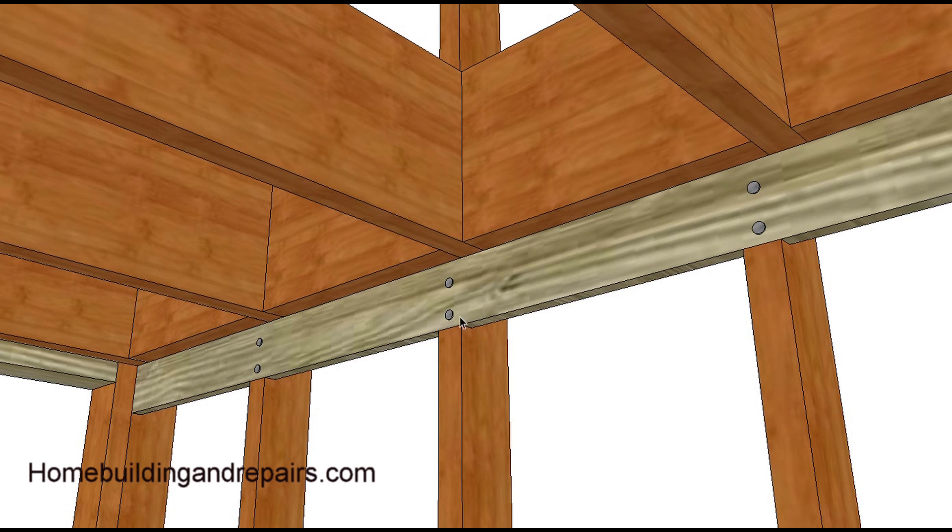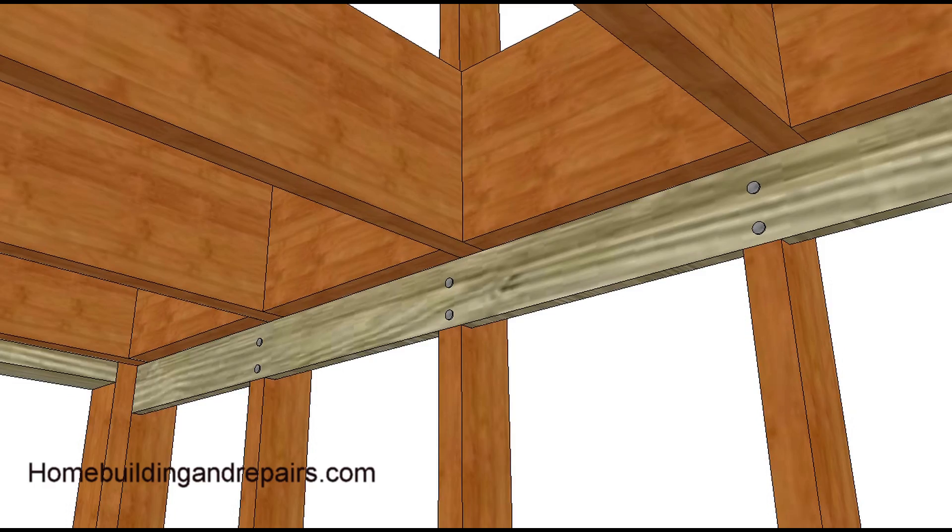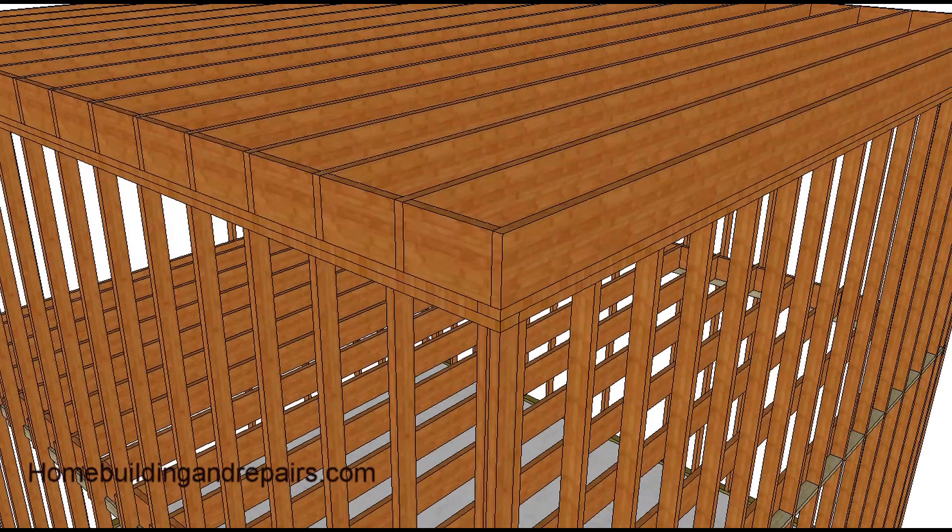Here's the ribbon — a couple of nails, you can probably use two 8d nails for this right here — and it will require a block. The block would be used for the floor framing and to provide you with perimeter nailing on the plywood. There's the notch for the ribbon; put it back in there and off to the top here.